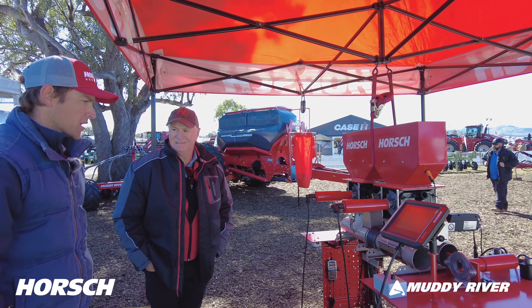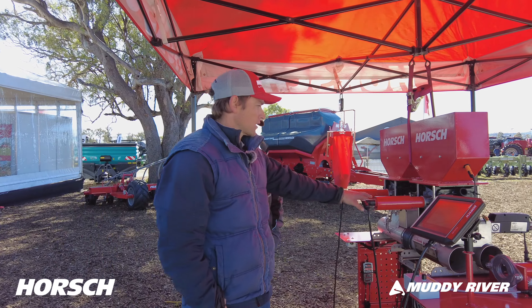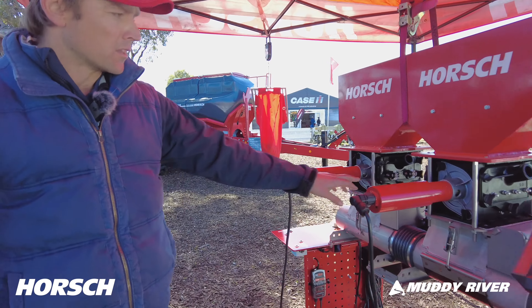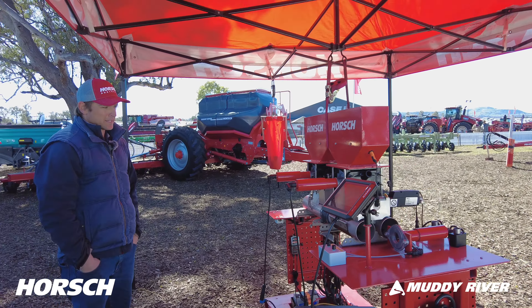Very straightforward — once you get the first calibration close, the second one you're dealing with 0.002 of a kilo difference. Very, very accurate. We planted canola this year — there's a little brush that bolts on the inside of the metering unit, lining up with the grooves in the canola roller. Canola can be a fickle product to get the right rate, but we were doing 2.2 kilos and over 100 hectares we were only half a kilo out — amazingly accurate. We were also running two products: canola in one bin, peas in the other, and the airflow didn't affect anything. You can run up to 120 RPM; we like to sit around 80. One bin, two bins, whatever you like — all through the screen.